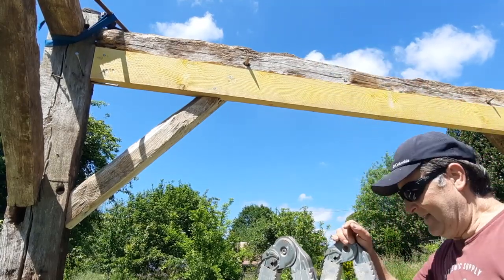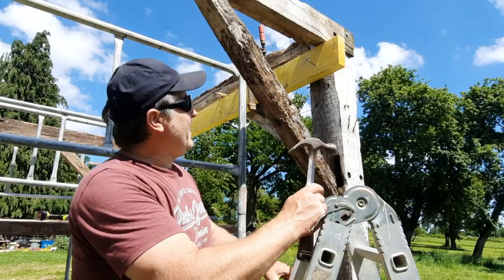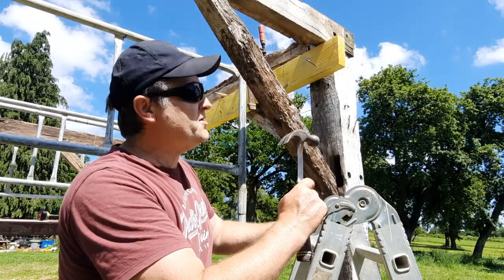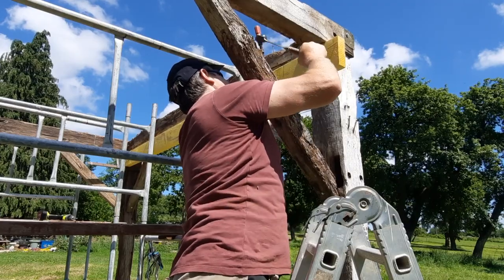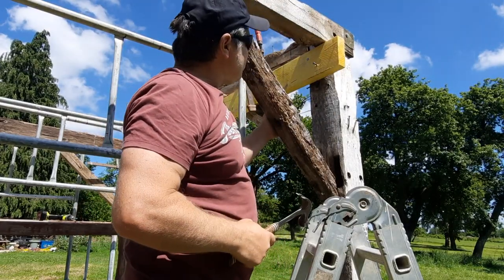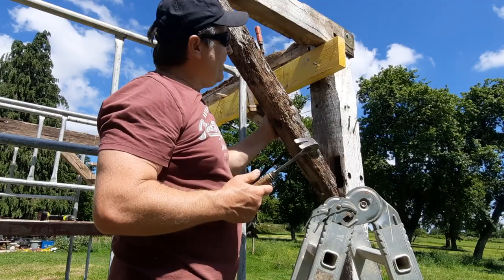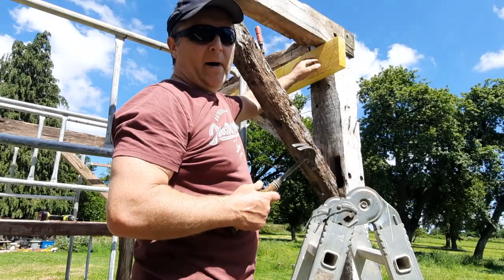On the other side now. I've pre-drilled this and I'm going to stick some nails in and trim the end off afterwards — that's often the easiest way. But the oak is like iron; it's bending nails over, so I'll probably just round that over and put a bolt in there instead.